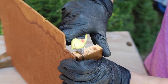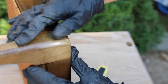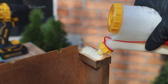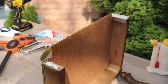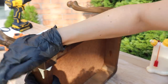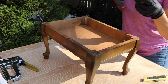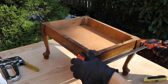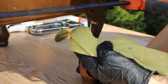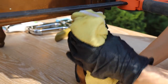It doesn't have to be perfect — we just have to be able to get a nice tight fit once we put the glue in this joint. When we put this back on, that's a much better fit. I'm going to put a little bit of wood glue in the hole, spread some on there, and do the same on the other side. We're going to get a lot of seepage, so let's clamp this and clean up the excess glue. When using wood glue, make sure you wipe up any spills — if you're painting, you don't want dried wood glue to deal with, and if you're staining, it's nearly impossible to stain over it.